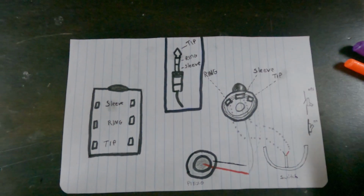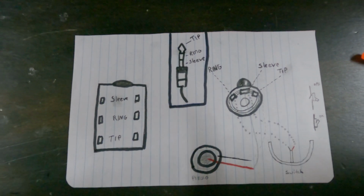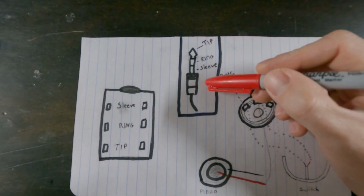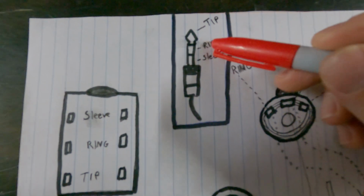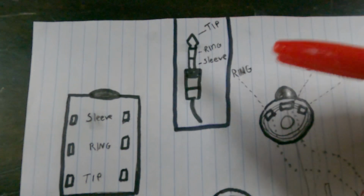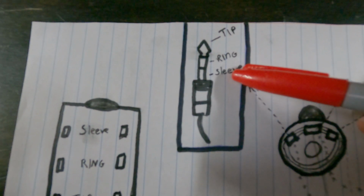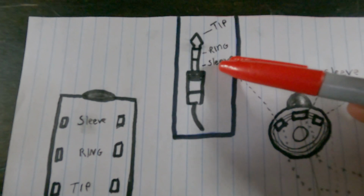We're going to start with a crash course in wiring up these piezos and triggers and switches and everything. So it's important to note that you need a TRS. This lovely diagram here is of a stereo TRS cable. You can see that there are 2 lines on it that represent your different zones on your trigger. So make sure you get stereo and not mono. That is important. On this we have a tip, a ring, and a sleeve. And then your wires are actually going to correspond to each one of these pieces here.